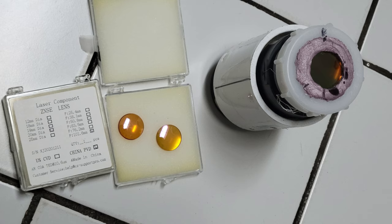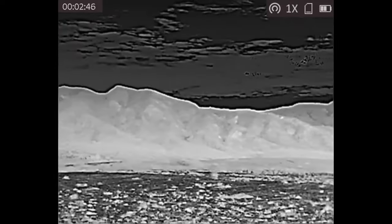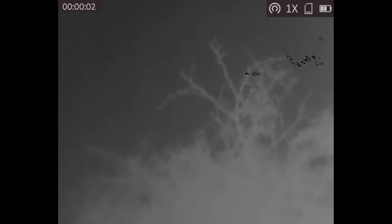There is a very specific focal length that gives the best results. Starting with some baseline video, let's get a look at what the surroundings look like normally, and from there I will show the evolution of the different lenses used in the production. You can see that as I started off at first, the quality was absolute crap and did not give me what I was trying to achieve. After that, I found a better focal length where I at least had some decent resolution and was able to determine heat. The difficult part of working with thermal is that the wavelength is so long that you actually lose resolution the farther you zoom in.